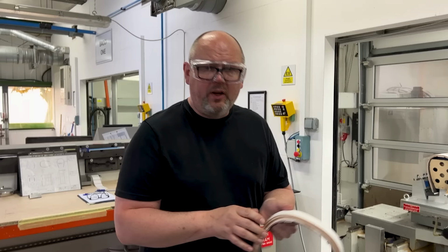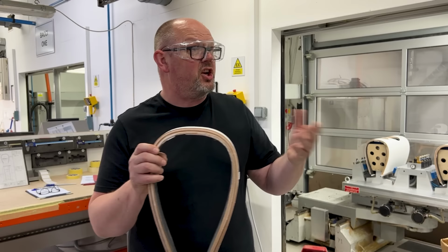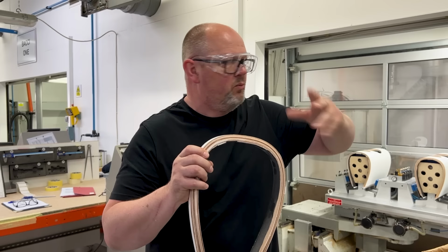If you look at the top of one of those wrap forms as it just comes out of the press, you can see at the moment there looks like there's a degree of separation around the wood. Now, fairly obviously, that's because we've actually applied the majority of pressure just inside of those edges. If you think about a sheet of A4 paper, you put it on your desk and you put your hand in the middle and press down, well, very naturally, the ends would slightly feather up, if you like.